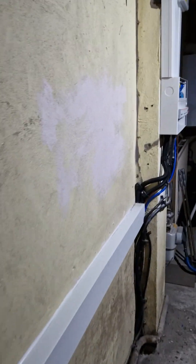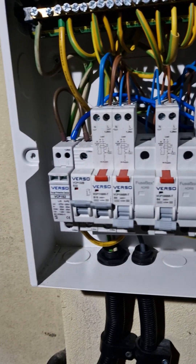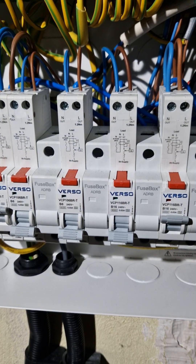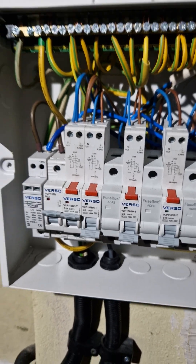There's no earth in here. Underneath there, there's a ring — there's a ring in the mains coming in. So at a later date we get the DNO to split that and we'll be right. But I'm going to link those two lights now with the same RCBO for now, just so the lights work, and then we are done for today.